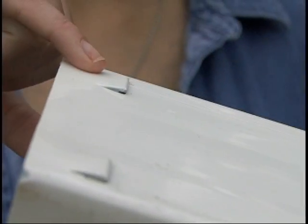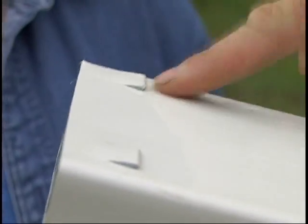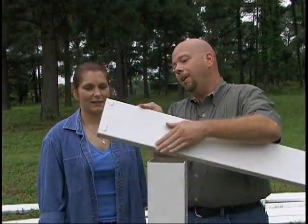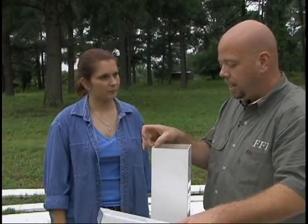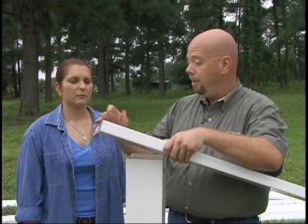What are these little things — is this a locking mechanism? Yes, this has pretty much become the industry standard locking mechanism for white vinyl fence. This is called a notch, and it's made by a notcher. Each side of this rail has notches on it. As it goes into this routed hole it's so tight and such a firm grasp that it can't come back out. The only way it can come out is if these are ripped out, and the only way they'll get ripped out is if it exceeds about 1,200 pounds of bursting strength — in other words, if a horse is running through the fence.